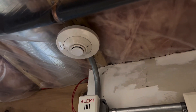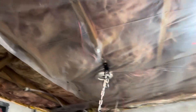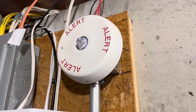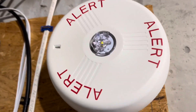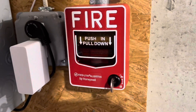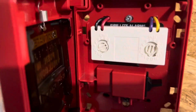Notifier FSP851, like last time. Still no smoke detector in here, which is perfectly fine. Right here is a Wheelock LSTWC3-AL — white ceiling mount, remote strobe with the Alert lettering, set on 95 candela.